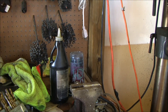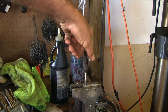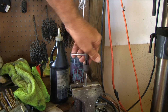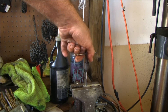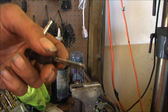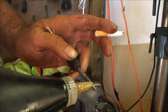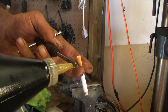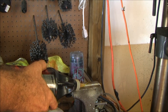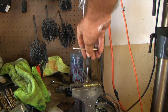So anyway, if you want to get some threads in a hole — some guys like to go in dry. You work that thing in a little bit and it gets stuck, and then you're screwing up your tap. I'm a firm believer in lubrication. If you're going in that hole, you want some lubrication in there and on what you're putting in there. Some guys will tell you use number one gold cutting oil, some say butter cut — everybody's got their own preference. My preference is gear oil.